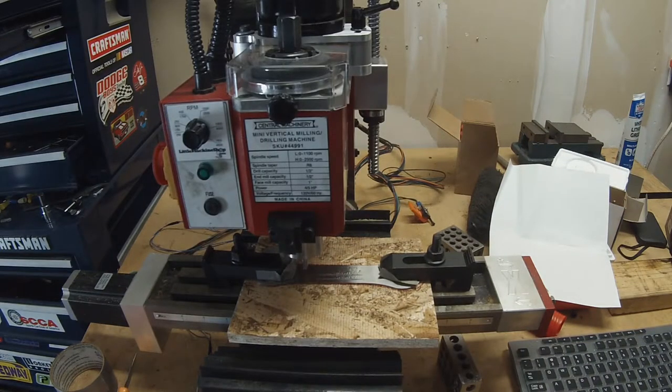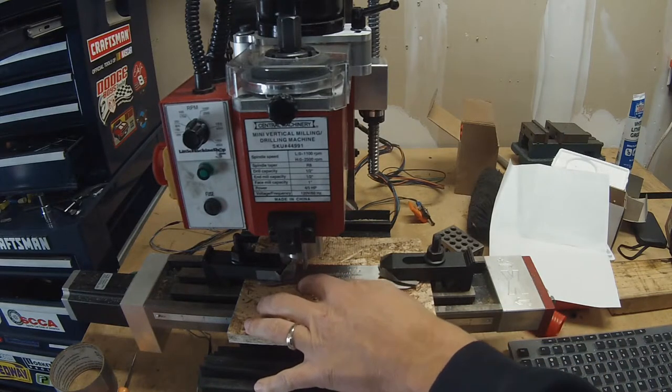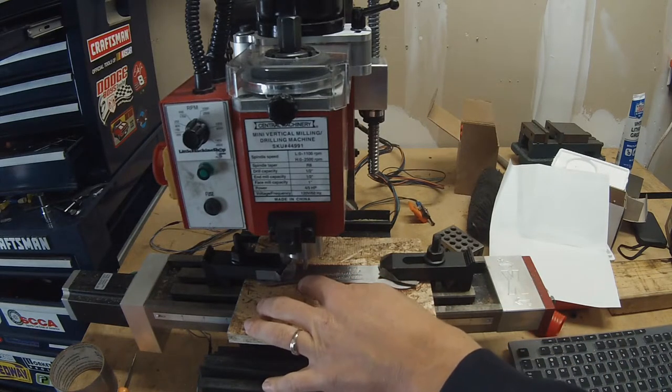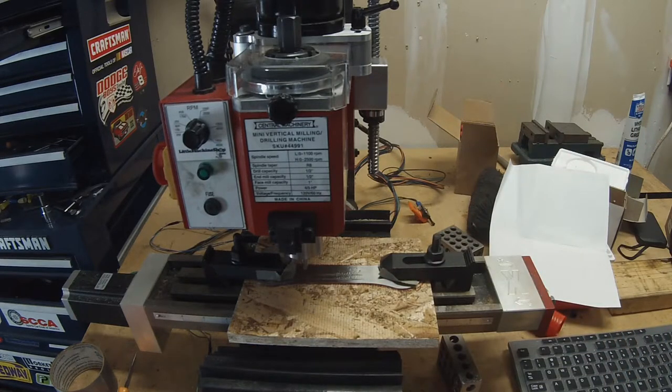I can't count decimal places — I was only adding five ten-thousandths at a time, not five thousandths. So what I did was run it down and touched off where it wasn't touching before, and that was only like eighteen thousandths from where we were. I think that'll be fine — I don't think the bow is anywhere near that kind of craziness.